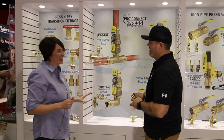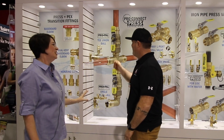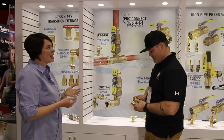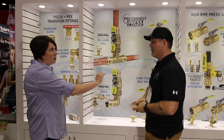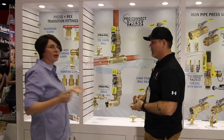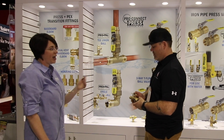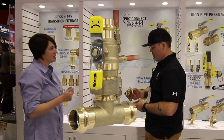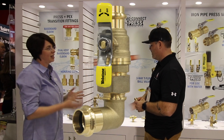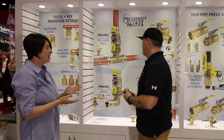These are my favorites from this year. I'm into the IPP, certainly, but this is Webstone quintessential. We watch what guys are doing on Instagram — they've got their run going through and they're pulling branches off, four or five branches on every install. We said, well, that's Webstone, we do that, let's just do it for you. Go ahead, have the valve built right in, super fast with the press connections. You've got your T, or if you just need to make a quick turn, we've got the angle built in there for you too. It's serviceable and it's a faster install.